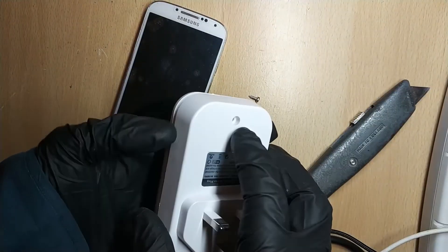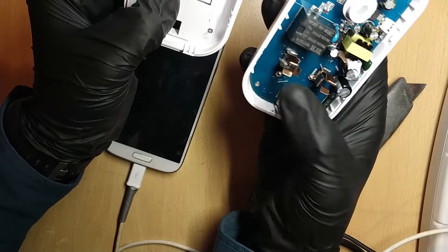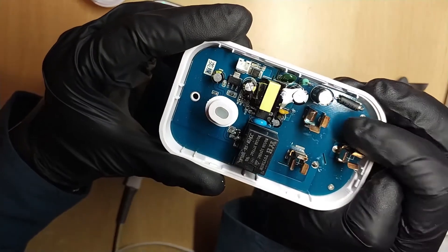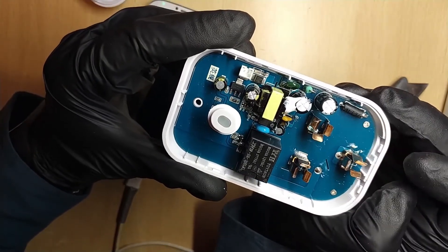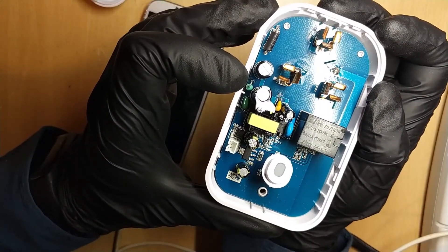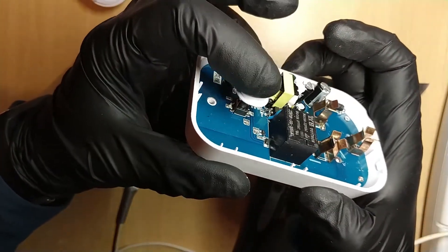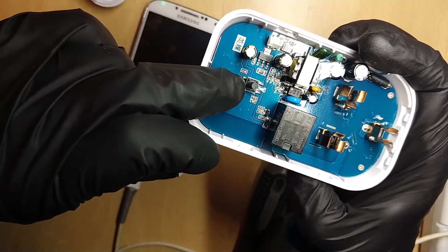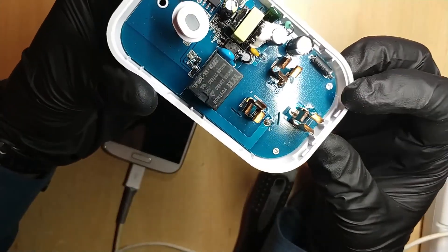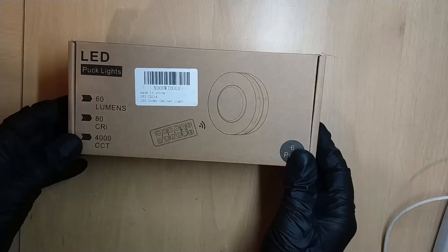I've opened it up with a knife. It is possible to flip the board around but it won't line up with the metal heads. There appears to be some kind of mini fuse with heat shrink around it so if it shatters it won't go everywhere. There's an opto-isolator and a relay rated at 10 amps at 125 volts — it also says 10 amps at 277 volts, so it is dual voltage. The red/blue LED and switch are here. There's a header I'm not sure about and a regulator. The tracks are quite wide but I can't see if there's any solder underneath.